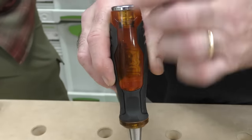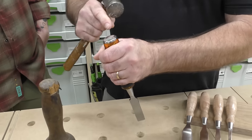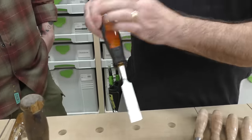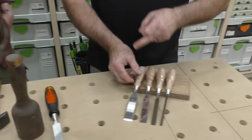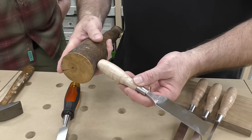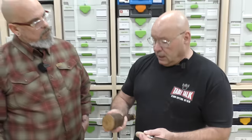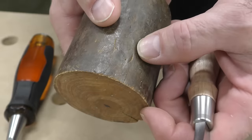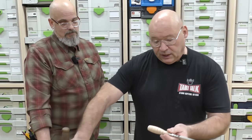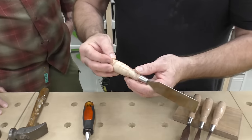The handles — let's talk about this one first. You'll notice it's steel at the top and a composite body, designed to use with a metal hammer. That steel cap is there to absorb everything — for longevity — because sometimes you'll just crack the handle. When you're using a wood handle chisel, it's always good to use a mallet. I've had this one forever, but over the years you'll see all the dings and dents. Blue Spruce makes a resin-infused head — it's 50% stronger, with resin pulled in under vacuum to fill all the pores.